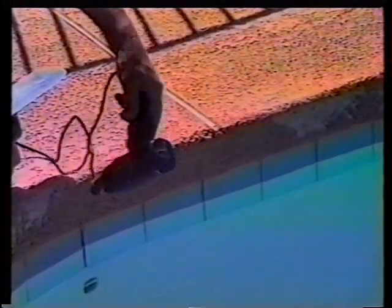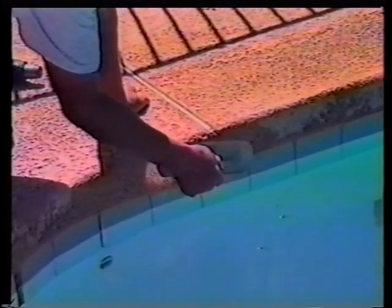Now just sponge off all the overspray. You may want to use a hot air gun, as in other repairs, to expedite the repair. When it's firm, simply trowel the cool deck and get a matching pattern like the surrounding area. If it's not set up enough, you can wait a few minutes or hit it with the air gun again and then trowel again.